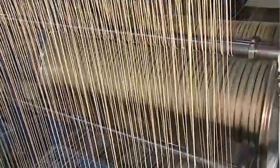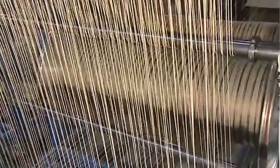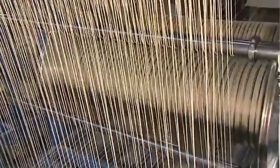The yarn placement or thread up specifies the position of each yarn at the needle. Since there are two needle bars, a step diagram indicates their independent movements, while the advance typically compensates for the stagger between the front and back needle bars. Pattern width is controlled by the thread up and step motion, while the stitch rate works with the step motion to control the length of the pattern.